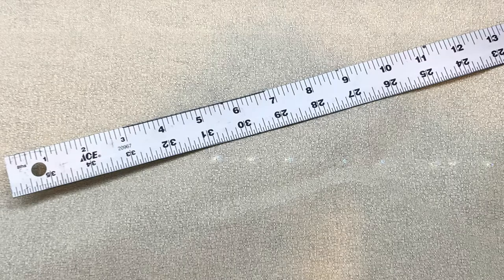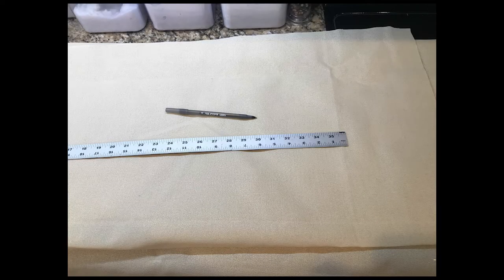First thing you want to do is measure the leaves of the doors to your engine room, keeping a couple things in mind. Give yourself some space around the edge and make sure that you attach these to the thick part of the door frame. I'd recommend giving yourself at least a half inch space around the dimension of your door frame from where you're going to start your tool storage system.